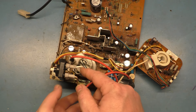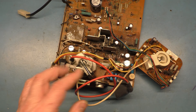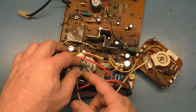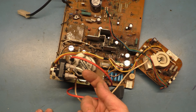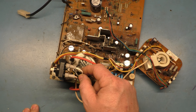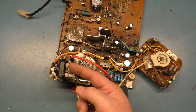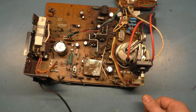It needs to be a short wire — that wire is like a foot long, and it doesn't need to be that long. To aid in the function of the flyback: a lot of times these flybacks will explode shortly after installing them and they get a bad reputation. I think that's because a lot of people aren't installing them correctly. When installed correctly they really don't have much of a problem. Part of installing it properly is that wire — you want to cut it to length. Run it through that opening in the flyback, go right up and make a little bend and solder it on. The extra excess wire — cut that off. It's detrimental to the operation of the flyback. Don't ask me why, because this is the amateur channel.